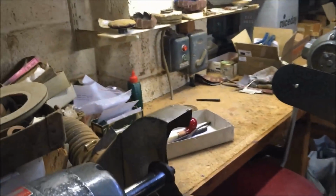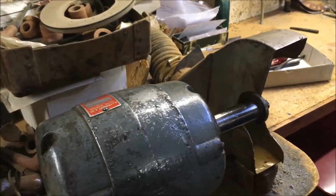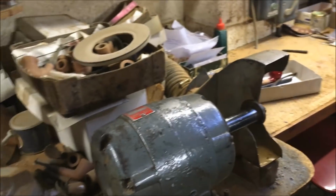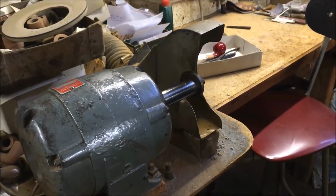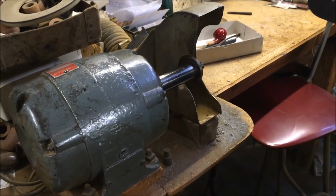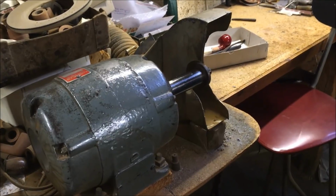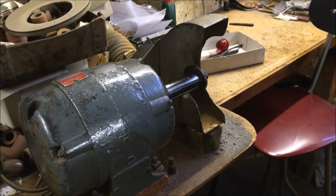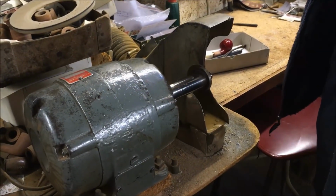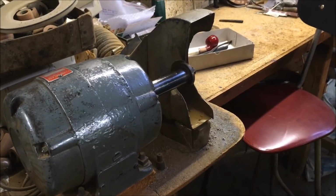My problem that I've had, I think I mentioned this to you last time when I came, was finding a motor which I could attach stuff to. And that doesn't exist. You can buy motors with a spindle, but then fitting something to that spindle, I can buy them in America. You can buy certain arbors which will slip over it with a grub screw and you can tighten it over it. But they're quite expensive. There's nothing that you can actually just go and buy that will fit over a motor spindle.